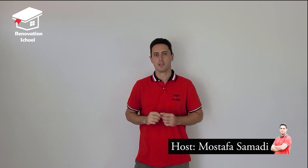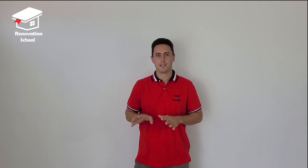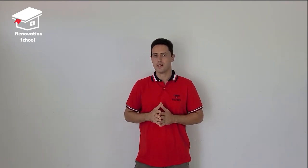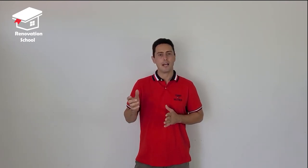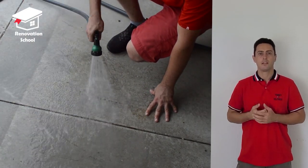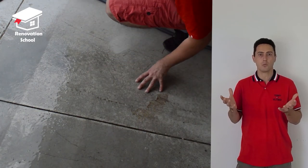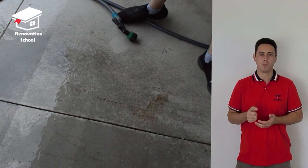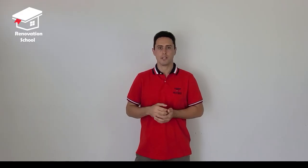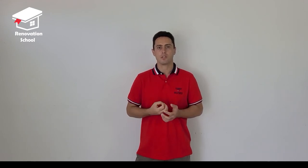Before you even empty out the garage, I had to figure out what kind of surface I'm going to be working on. In my case it's just bare concrete — no sealer, paint, or old epoxy on top of it. I simply poured some water on it and noticed the concrete was absorbing it, changing color and getting wet. If you have sealer on top and you spray water on it, it doesn't absorb — the water just slides right off or sits on top.